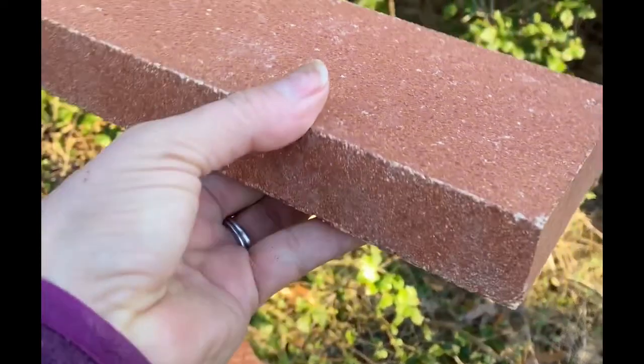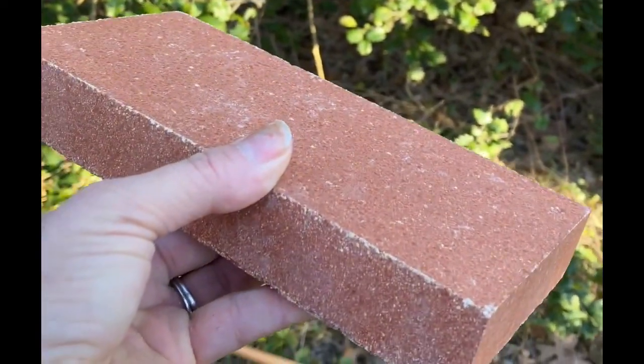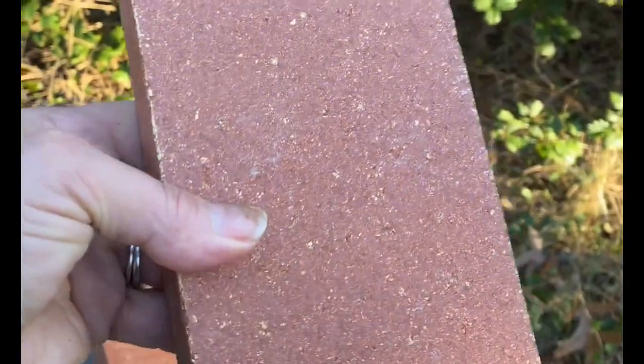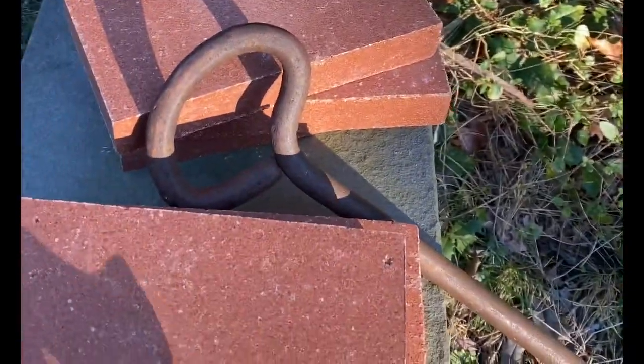And just want to show you what we use. We use these split fire bricks, and we also had four hole fire bricks. So we set up the four hole ones at the bottom, and then we put all the splits around the perimeter, the inside perimeter. So yeah, so that works.